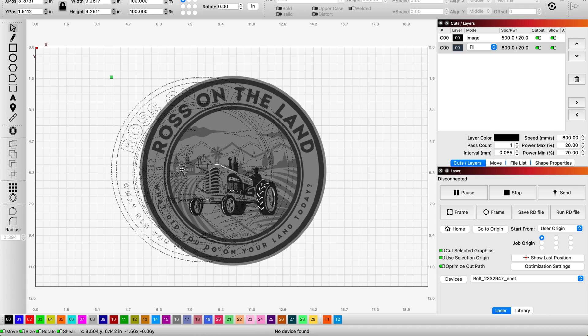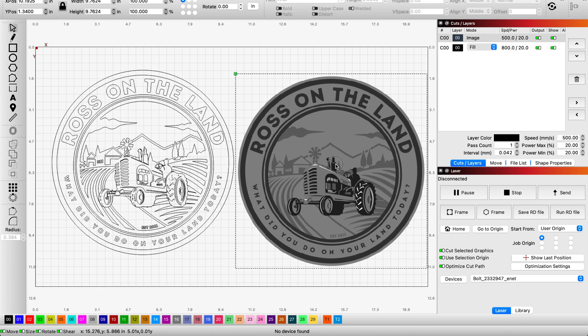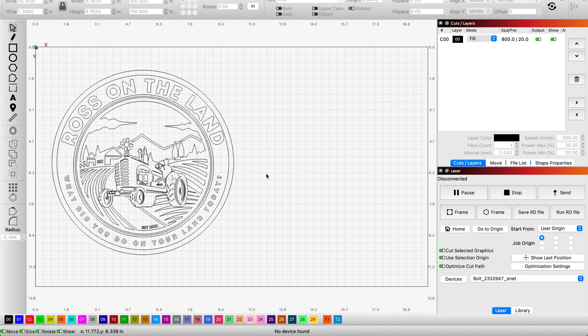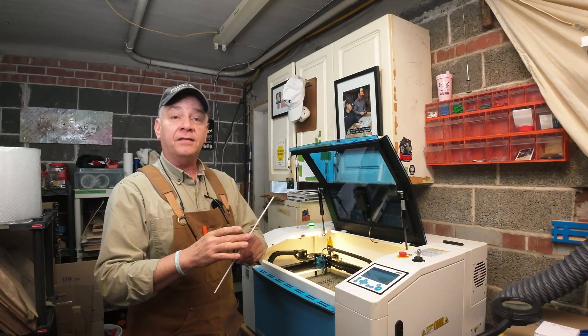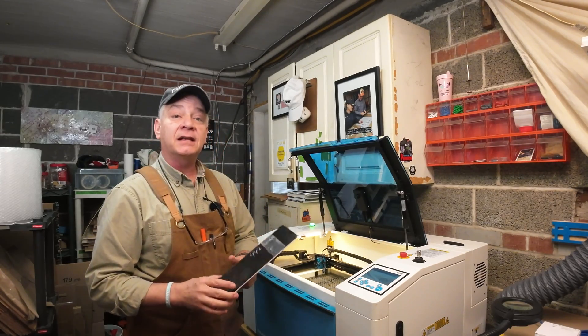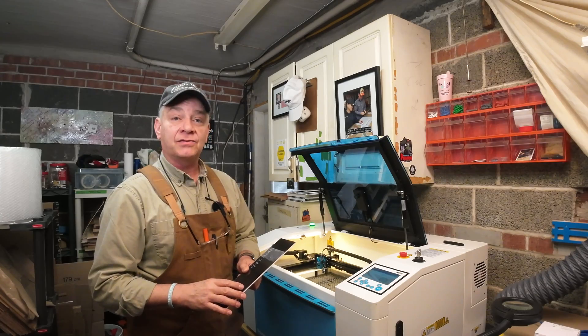If I move this aside, I'll give you a side-by-side comparison — there are the differences between the cut file or the engraved file and the original image. So let's get rid of that image and run our test with the 1.5 inch lens on my 1/8 inch Rowmark first to see what it looks like. Before we go any further with the logo, I needed to do a cut test, because I've provided settings for the 1/16 Rowmark but this is 1/8 and I haven't cut it yet. I'm going to use the same cut settings I used for the 1/16 with the 1.5 inch lens and see if it gets through. If it does, great; if not, I'll swap to the 2.5 inch lens.